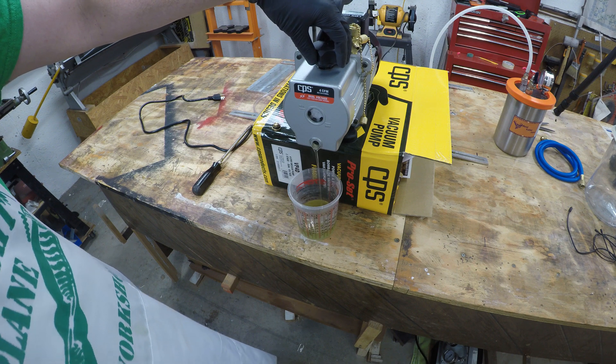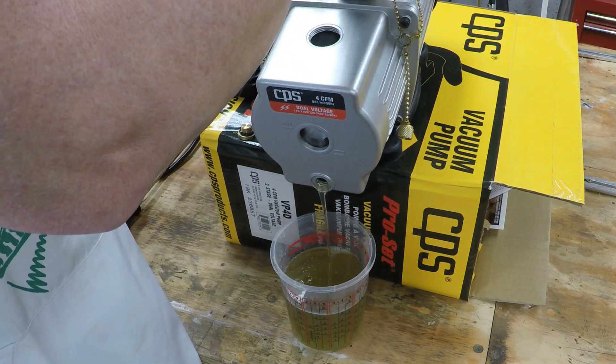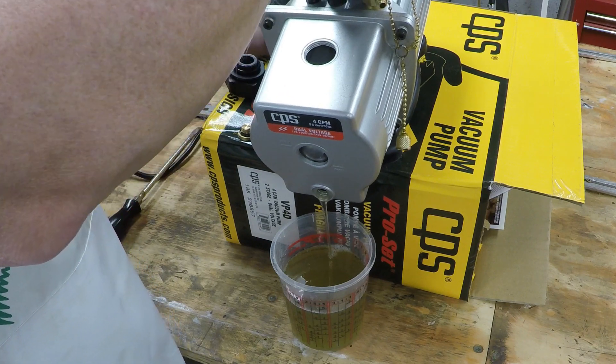You want to loosen or remove the cap on top to help the oil drain out a little faster. Most manuals will recommend that you run the pump for a little while to get that oil warmed up so it'll come out easily — you could do that, though it's not necessarily required. You'll probably have to tilt the back end of the pump up a little bit to get all of the oil out.